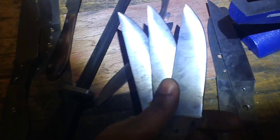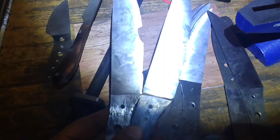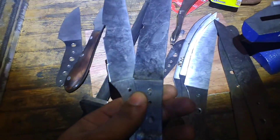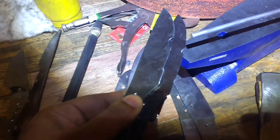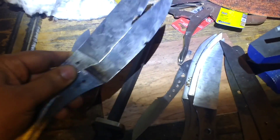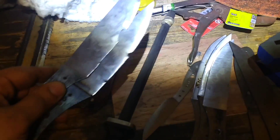These three are survivors, these two did not survive the testing. Was it the heat treat? Is it the steel? With my rudimentary caveman testing, these guys that failed are just under ten thousandths behind the edge with a 15 degree per side. All my angles are always going to be 15 degrees per side — I'm never going to increase the angle because it cuts like shit.